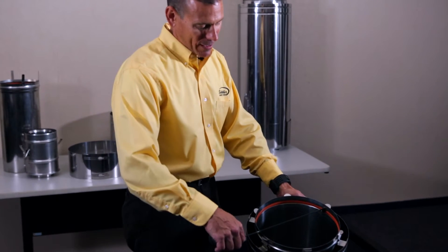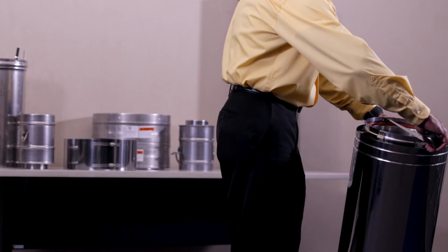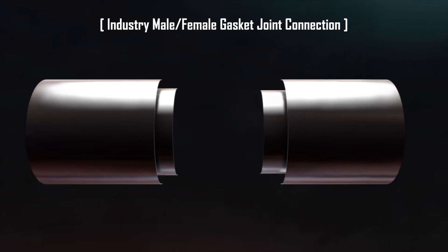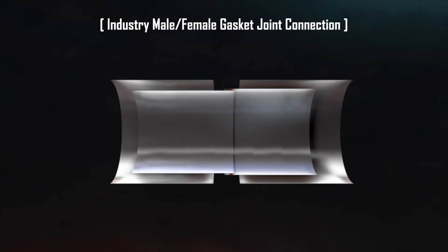Here's an example. This product here is 10 inches in diameter. If I measure it this way it's at 10 inches, but cross section it's nine and seven-eighths — somewhere a quarter inch out of round on a product before I even handled it at the job site.